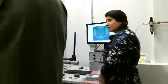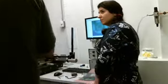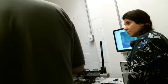So all the packs are done in one go then. This is bonding done not with a wire. Yes, that's right. Normally your die would get wire bonded first, and then sometimes you put bumps on a die, and then you take that die with the bumps and place it on your substrate. So this is not attaching any wires. Yes, bumps. It could be stud bumps, could be regular BGA style.